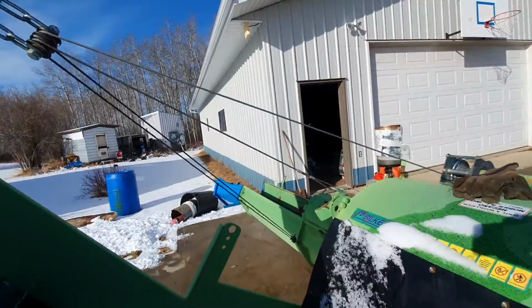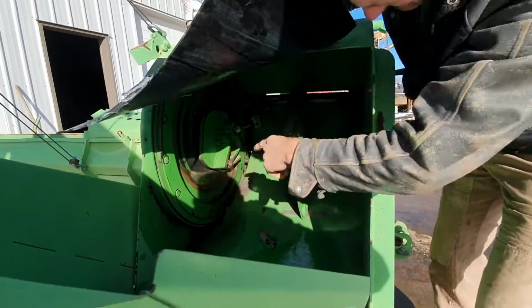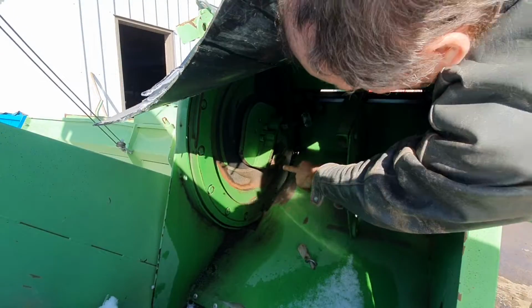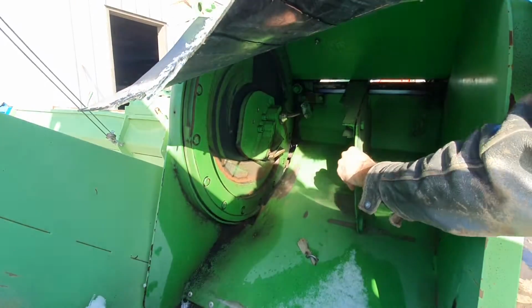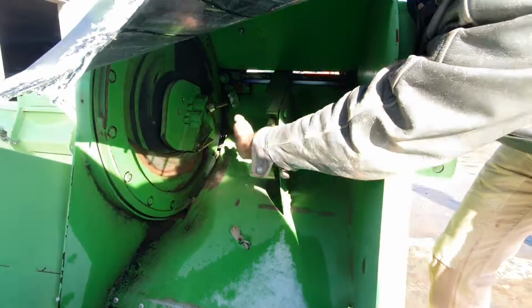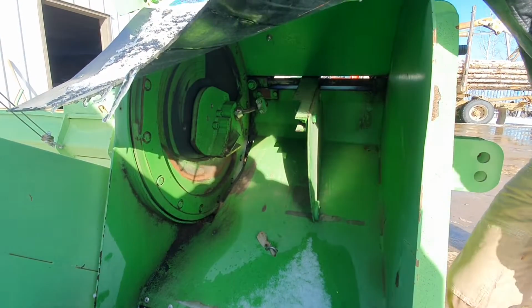When you're operating it, here are the knives inside here. It rotates around and it's like a moon-shaped crescent, and there's a wedge in there that when it comes around, it splits the bottom of the tree off as it cuts in half. This is the part that adjusts for your length wherever you want, and so when it bumps into that and then slices, the next one comes in and bumps into this piece.